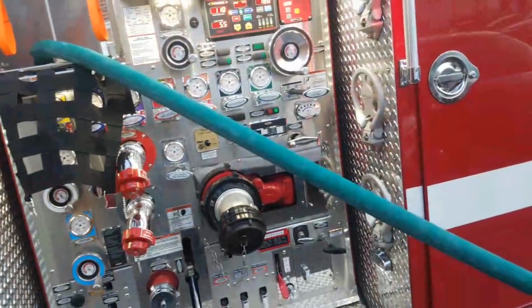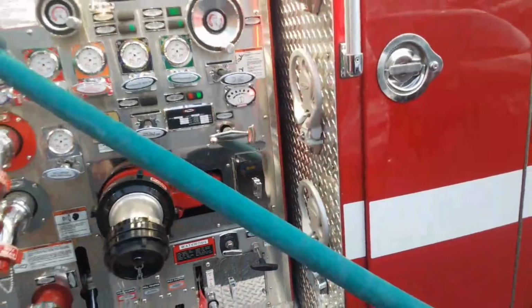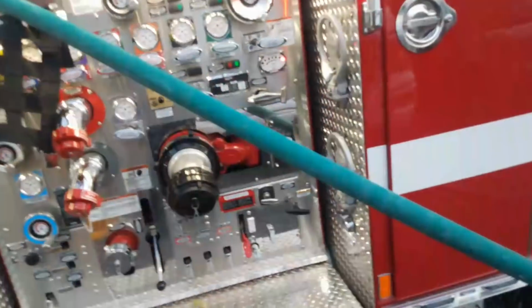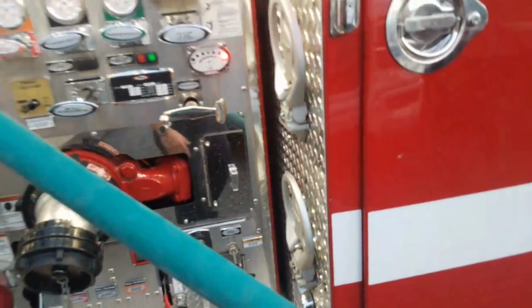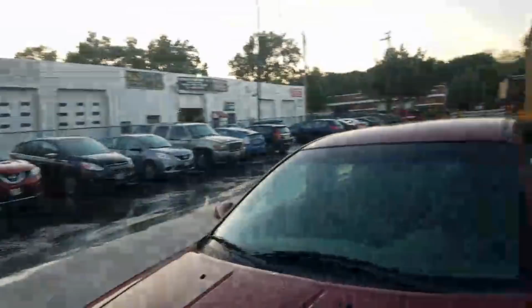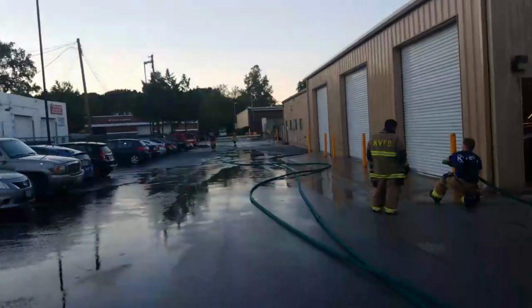1.75 squared, street math wise, is 2. 2 times 12 is 24, rounded up to about 25. Your friction loss with this line is approximately 25 PSI per 100 feet. If you're dealing with 200 feet of it, it's 50 PSI of friction loss. However, if you have a 2-inch line, it's a 6 Q squared, so you have a little bit less than half the friction loss because the 2-inch nozzle has a higher Q. But that's just some basic stuff. Sorry, I know it's too much for the average person, especially yelling in front of an engine if you've never studied this stuff. But that's why you have less pressure in a bigger line: there's less friction loss to overcome.